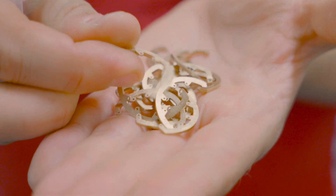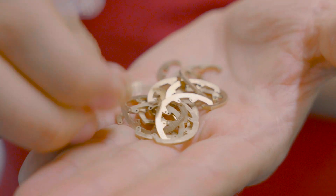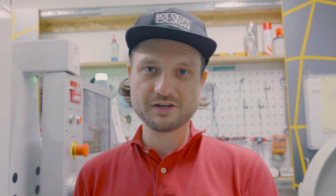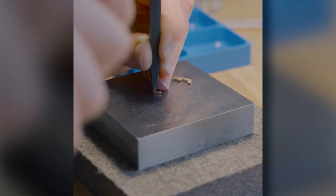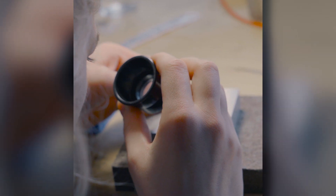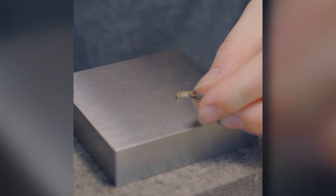We need to engrave the gold rotors for a batch of customer watches that need to be finished. Those are the gold rotors that Carolyn already prepared. We receive them as a fine casting and then Carolyn finishes them — she grinds them, polishes them, drills the holes and taps them with an M1 tap, and then gives them a hall mark for the 18 karat gold. Then they are ready for engraving.